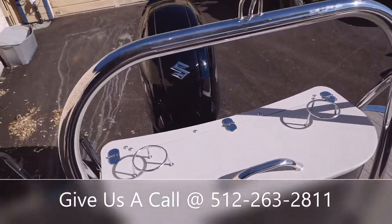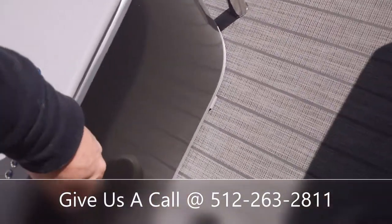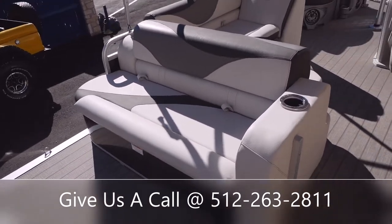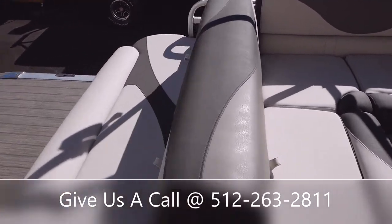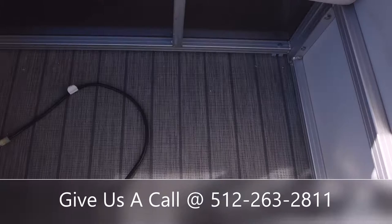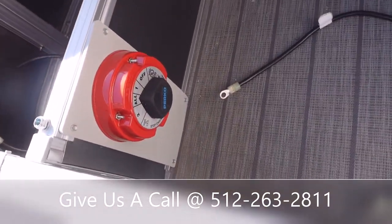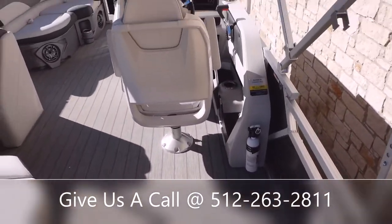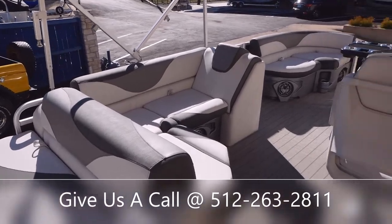You've got additional cup holder areas here in the back, and there's a cubby that's basically designed to keep the wiring to the motor tidy while also giving you a little extra storage. This is your Cruise Rear Bench — you've got a bench on both sides back here. There's tons of storage underneath the bench, and here's where your batteries will be installed. There's a battery switch right there — it's a 2-1 All and Off. You typically want to run that on All, charging both batteries. If you stop to listen to music with the boat off, flip it to 1 or 2 so you're drawing from one battery and still have power to get back home.